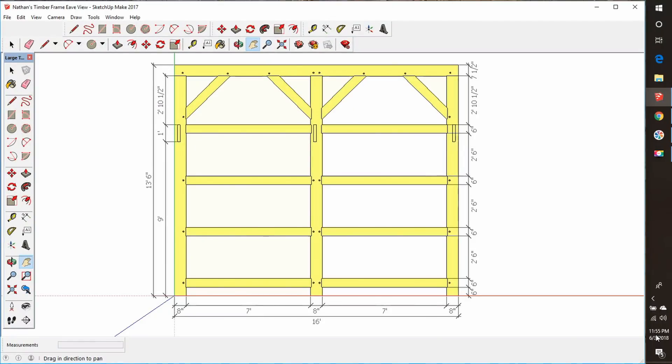This would probably be the back wall of his sharpening shop. This is going to be one of the eave walls. We don't have the doors shown here. The other eave wall is pretty much going to be a mirror image, except a couple of these girts will be left out for a door. Like I said earlier, this is all just kind of guesstimation — this is how I would like it to go, this is the size timbers I feel would work well, but we don't know for sure until we run all this stuff through the load calculators.